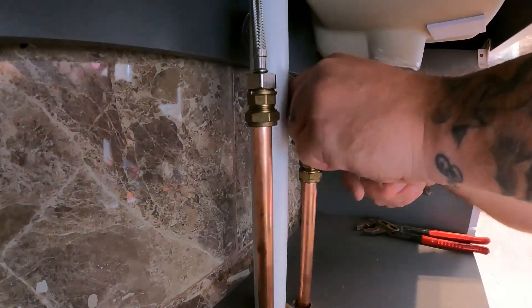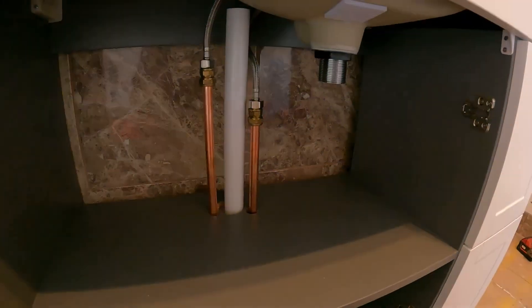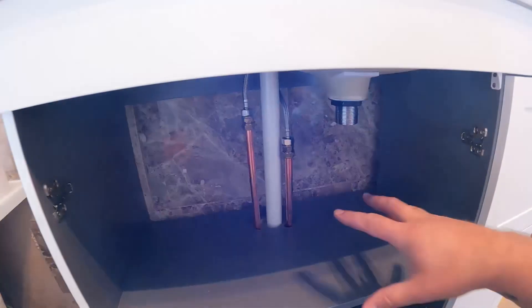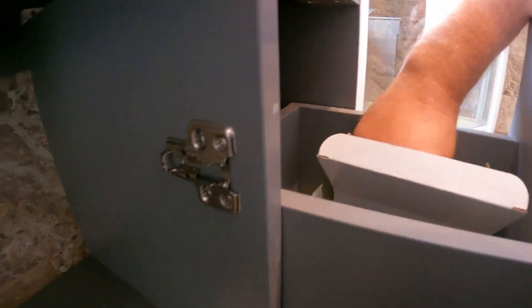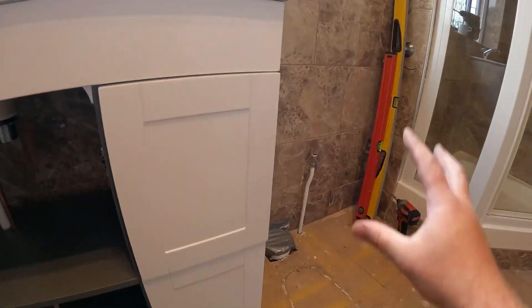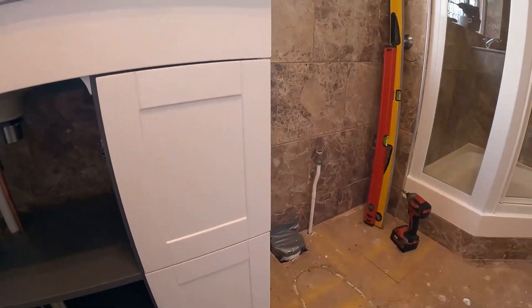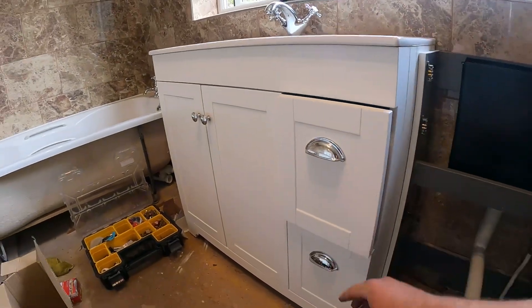Just nip that up — not too tight. I've got to pick a trap up tomorrow from Plumb Base along with a few little bits, including a couple of little elbows and maybe a street elbow for there so it's going to go in the back of the trap. We'll get the doors back on, spend about 10 minutes getting the little handles put on, get the doors on, and get the handles on there. I think what we're going to do is get that toilet unit in because we've got to pick up a flexi for that and some other little bits for the concealed system. Then we'll shoot off and pick the bits up for tomorrow, get back, finish this, and get the toilet in. For the bath panel — I personally don't like fitting bath panels so I've had a word with the chippy, he's going to come out Friday and get that done. That's the handles on the vanity unit now — it looks really nice, that style works with the taps.